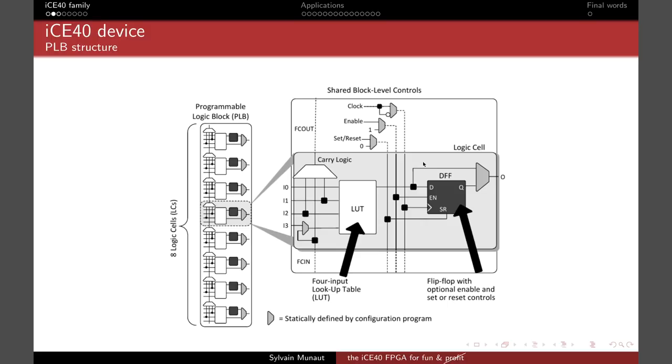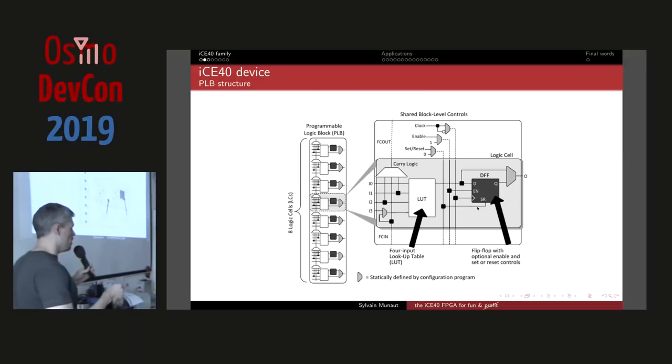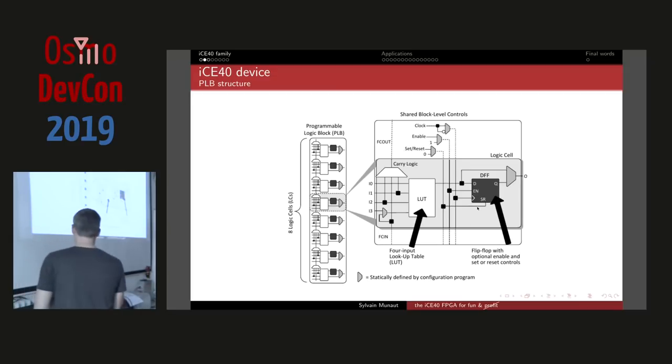Something that I found really strange in that FPGA, contrary to Xilinx, is that the set/reset, when it's configured in synchronous mode, is actually gated by the clock enable. So if clock enable is at 0 and you send a reset, the flip-flop won't actually reset. That's rather strange. When you code your logic, you should basically use asynchronous resets, else the synthesis tool will have no choice but to do a logic OR between the reset and the clock enable signal to generate the actual clock enable signal. It's just a little detail, but if you have a lot of flip-flops that are reset with clock enables, it can drastically reduce your logic use and improve your timing.